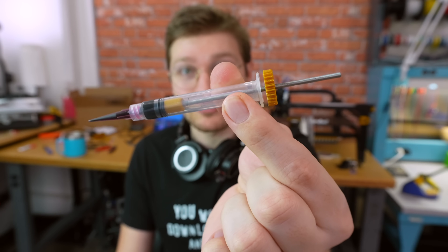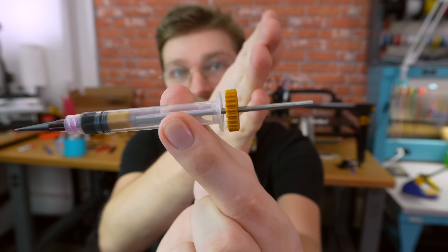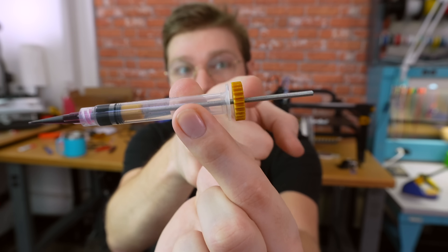This will just drop right in. As long as this screw is held in place in this orientation, as it spins it's going to drive the screw in and out, and that's going to extrude the ink where it needs to be. I'm a little worried about this NEMA 8 — it skipped steps a little bit when I was driving this without any ink in it. There isn't a fantastic way of pulling out all the positions of all the pads, so I'm just going to manually jog through and pick out all the positions and write a little slicer that drops all the ink down where it's supposed to go.